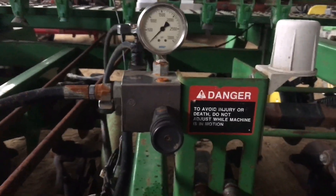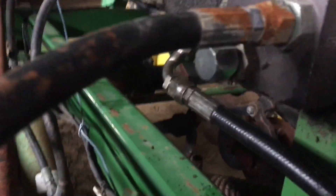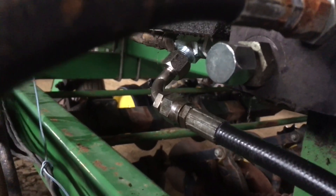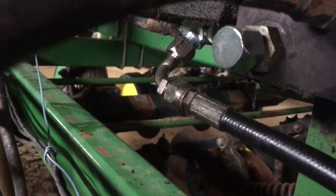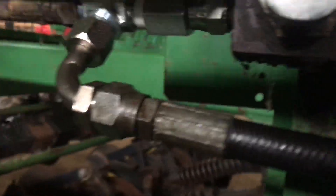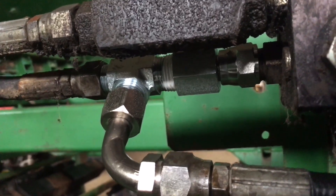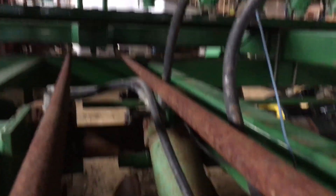Here's our active down pressure valve. Of course I've got the cylinder lock up here and it's on. I hope you can see — there's my V2 line, there's the line that's capped, and the one that's going to the 90 right there — that's the original one from the tractor's remote. And as you see I've got a 90 and a T to that back side of the valve, and that hose is the hose that goes to the raised position of the hydraulic cylinder.